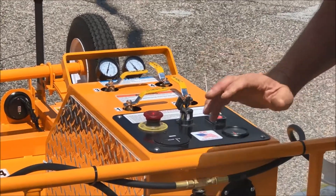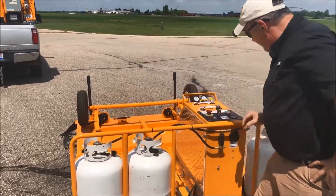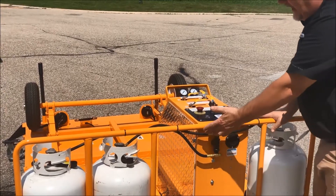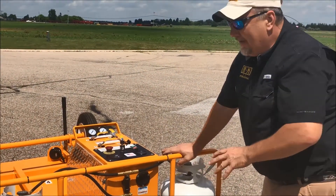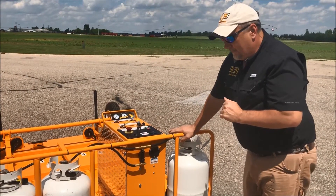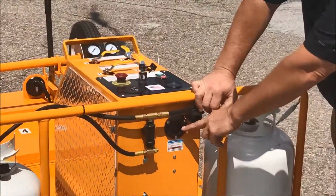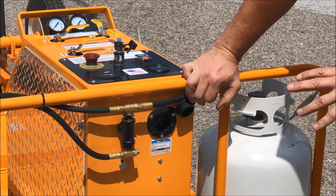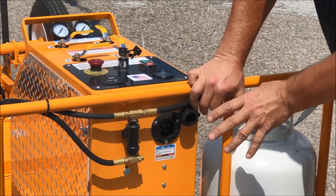At the end of the day, when you're all through heating, I like to turn off your propane bottles. So I'll close off my cylinders. If you watch this needle, it'll peg down, showing me that I no longer have any propane in the line. I'll turn my key off and that fan is going to run automatically for two minutes — but this is just at the end of the day, the last heat. I like to purge the system of all the propane in it. Over here is our deep cycle battery charger — it has a built-in charging system. When it needs a charge, it'll take a charge. So if this is in your barn or shop, please make sure that you keep it plugged in at all times. Just like your boat — if it needs a charge, it's going to take a charge.